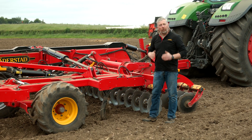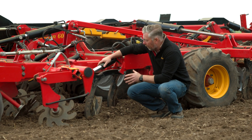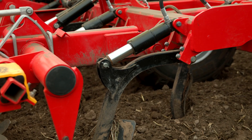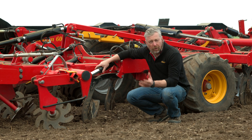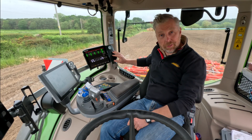Here's the top-down leg and the cylinder that protects the leg for kickback from stones. We can also change the pressure on this using e-Services. Here we have our familiar e-Services with an iPad in an e-keeper, like we have on the planters and seed drills.